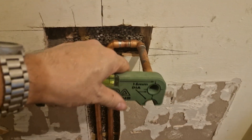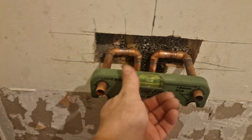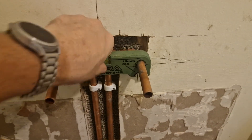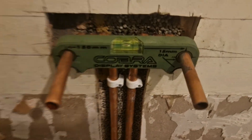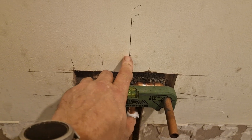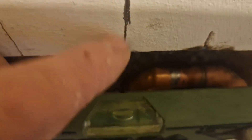You can do it like that, or do it like that — so you know that when your pipes come out the wall, everything is bang 150 and bang level. I've got a center line there for the center of the bath plus 10mm for tile, and there's a little notch there which you can line up with your center line, which I did.